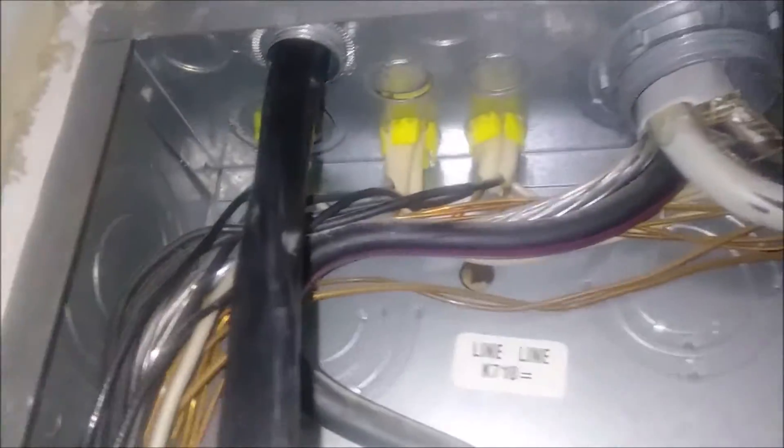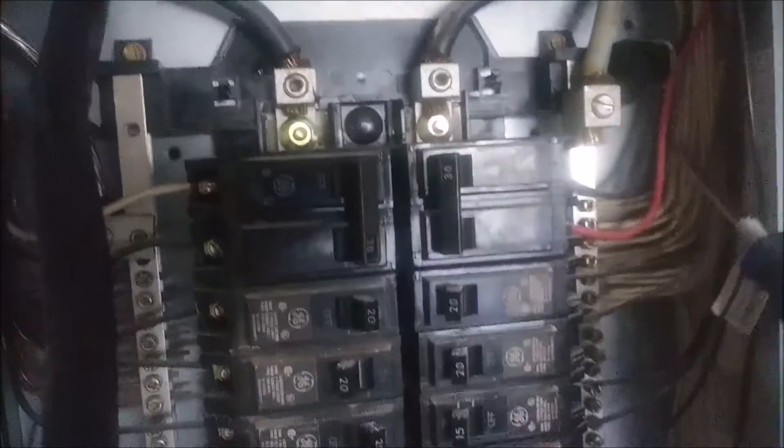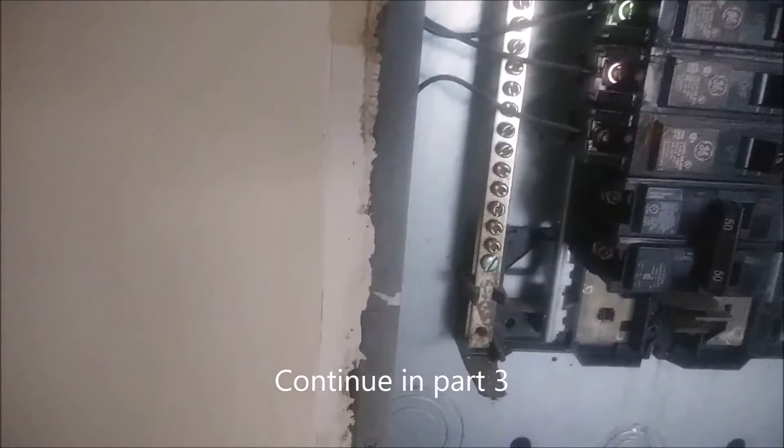That's the way it looks from the side — these are actually protecting that wire. After that, we're going to cut it to the normal length needed. You can see this cable here which is also 220V for washer and dryer, and here is 220V for the AC. You have to have quite a bit of wire going like that. The same thing here — you have to get this wire going from here, through here, down to here. So we're going to cut it as needed.